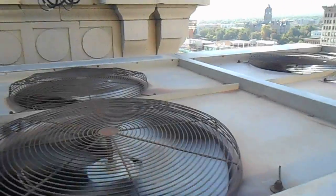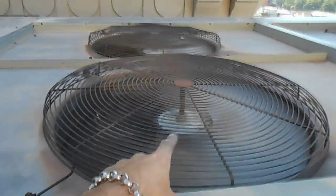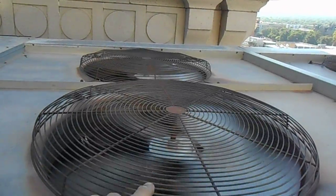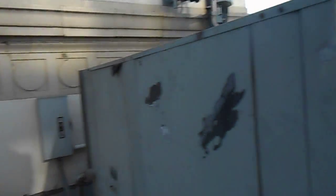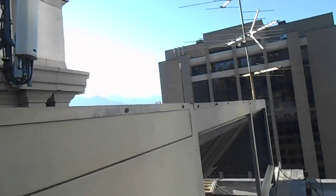The reason I'm here today is that bad boy. It looks like it's doing all right, but it's actually running in reverse because the motor's dead. These three other fans are running full bore, pulling air back through and running this one backwards. I've got a condenser fan motor to replace up here, so the joys are hauling tools, motors, and everything up through that maze of pathways.